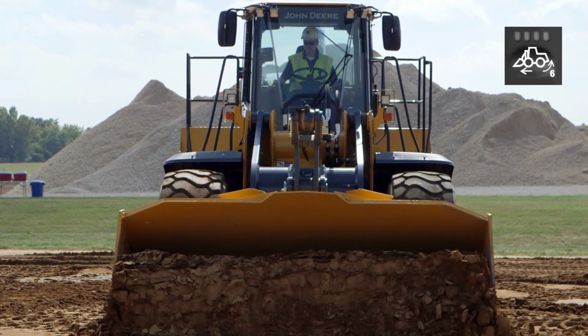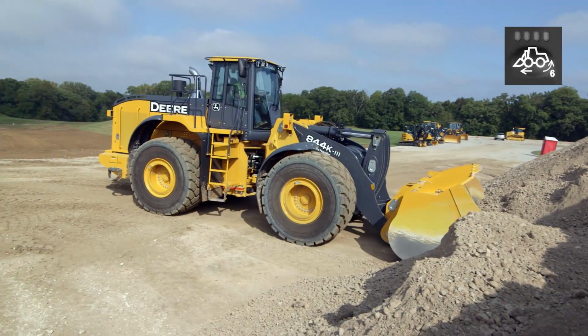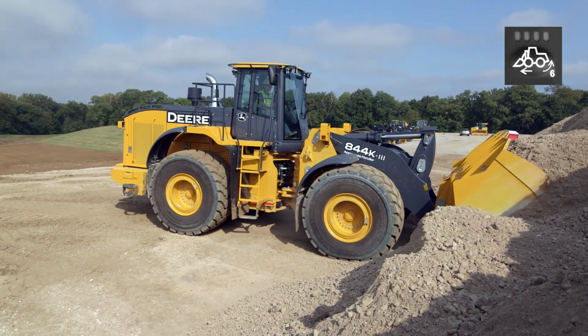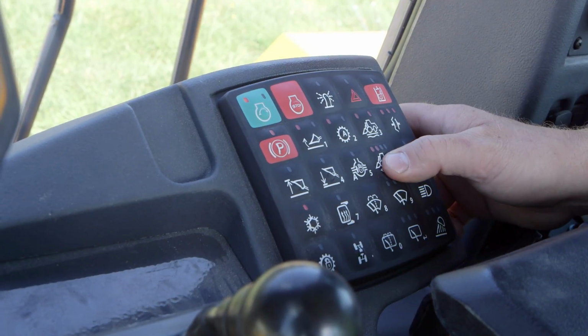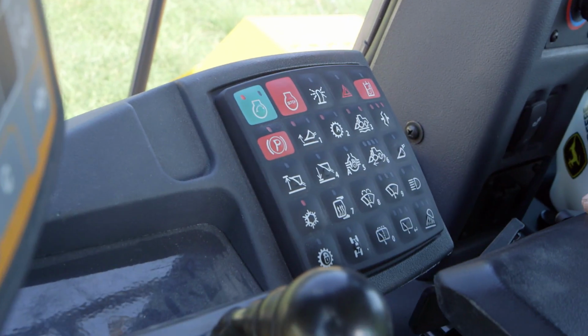With no lights illuminated, the wheel loader will have full power. If this feature is used incorrectly, the machine will feel weak when loading the bucket in first gear. If this is occurring, it is recommended to reduce the setting or shut the feature off.